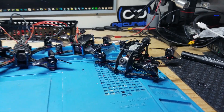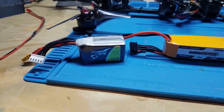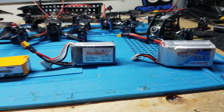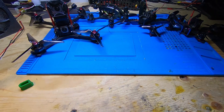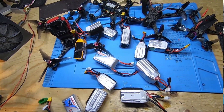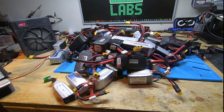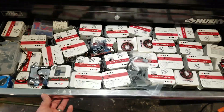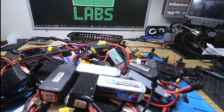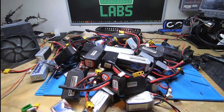I've considered making the switch on my 3-inch quads and actually own the equivalent 6S motors, but there are very limited 6S battery options, whereas batteries of all sizes exist in 4S. Sometimes running lighter 450mAh batteries can be preferable on smaller tight courses where you don't need to punch out much. So keeping diverse 4S options alongside 6S would be great. A lot of us haven't switched to 6S yet because we have plenty of healthy 4S batteries we want to keep using — some of us have a significant number of them. The concept is extremely compelling, since theoretically you could run 4S and 6S batteries on the same aircraft with different profiles. I've seen statements that there's no excuse not to get 6S batteries, and even that you should build new 6S rigs on 4S motors — and this seems too good to be true.